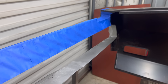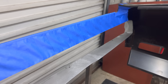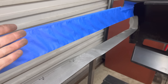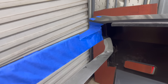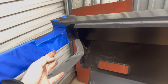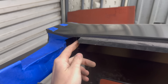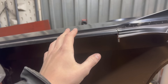The next part of this tail panel project will actually be the inside of it. I've got an interior panel mocked up here — this will close off this area so it's not just exposed. I'm going to put some dimples in it as well so it can match that piece right there. In order to start working on this piece and get it measured out, I need to get the trunk gutters set in place, so I can measure from the bottom side of the trunk gutter to the bottom side of this lip and figure out how I'm going to blend this corner in.